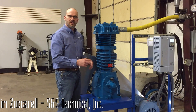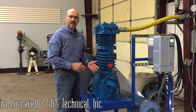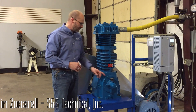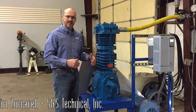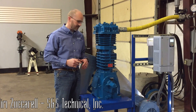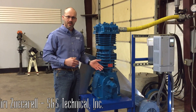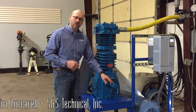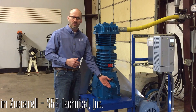There will be a little inset on this video where we actually demonstrate that. But that's pretty much all there is to it. Occasionally, when you've done an oil change and you're trying to get oil pressure when you start the compressor, you can find that it doesn't immediately build up pressure. If that's the case, one of the simplest ways to alleviate that — typically it's a result of the pump losing prime and there's a little bit of an air pocket — we recommend just loosening the oil filter a bit to let the air kind of burp out.